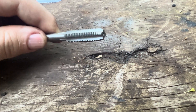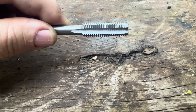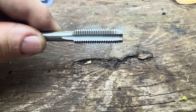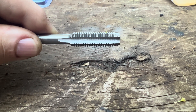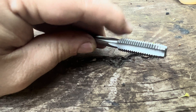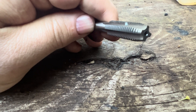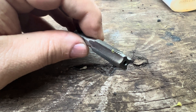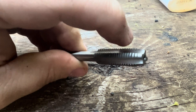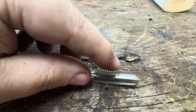A tap almost looks like a drill bit but it's not. Here's the actual tap — what this does is you push it straight and evenly into a hole that already exists where the threads are worn out or damaged. Or if you're making a new hole, you take a regular drill bit and make the correct size hole that fits the tap. As you can see, the tap has these little grooves in it, and as you turn this it cuts into the material making threads.